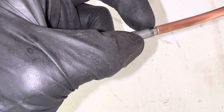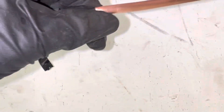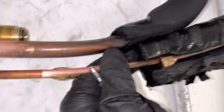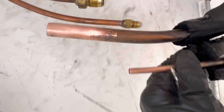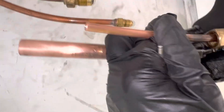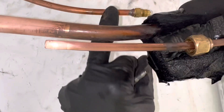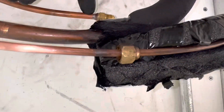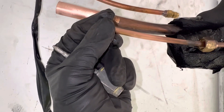You don't shove it up on the ramp because when you braze it you're going to shove this piece of copper inside this piece of copper. As you can see here on this one, they're slightly different — this is the OEM coming out of the air handler and this is the quarter inch that it's called for. So this one just happens to be smaller than this one, so it will fit perfectly inside. When I cut this off I actually have a quarter-inch hole instead of that little tiny just-over-a-sixteenth-inch hole after you cut them.